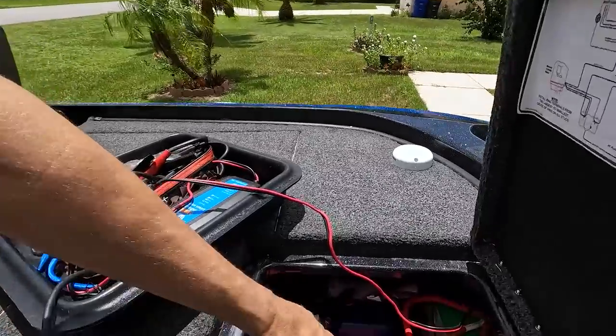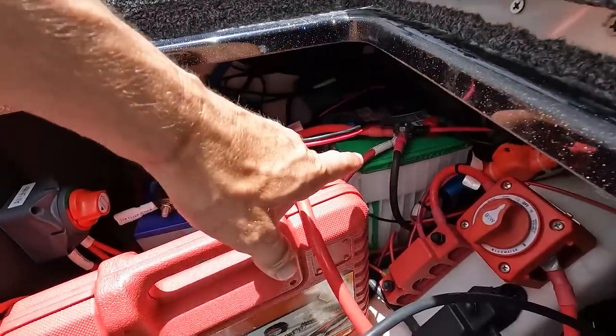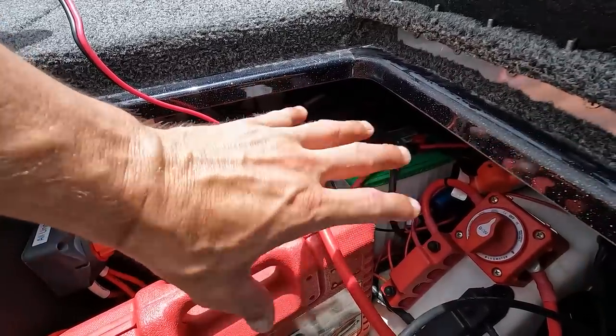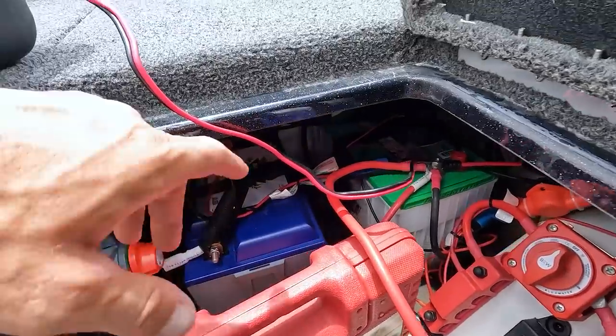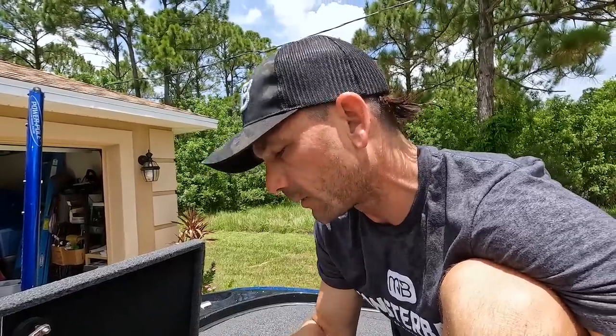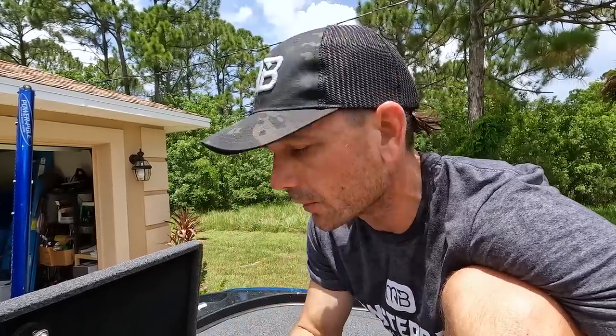So that's my cranking battery back there — it runs my bilge pumps and all the boat stuff, but not my electronics. Then I took another 100Ah Battle Born lithium and I run all my graphs off that, with the C-Clear harness, so I have a dedicated graph battery. I never have to worry about killing my cranking battery or running out of juice for the graphs. When you're running three or four graphs, it's a lot of current — especially forward-facing sonar like Active Target, which absolutely drinks power. So in total I run five batteries: one for sonar, one cranking, and three trolling.